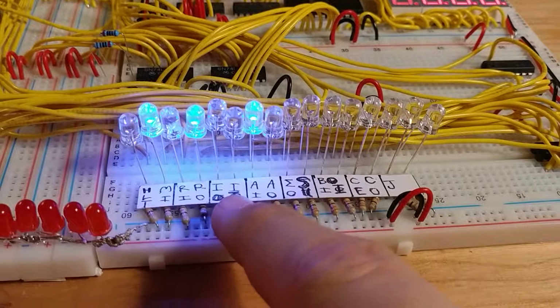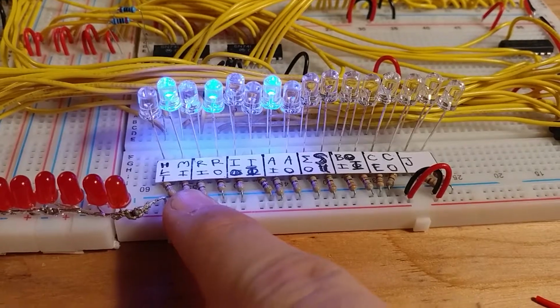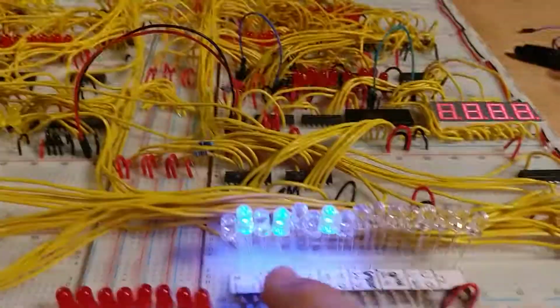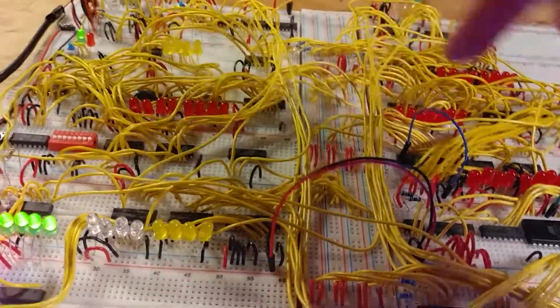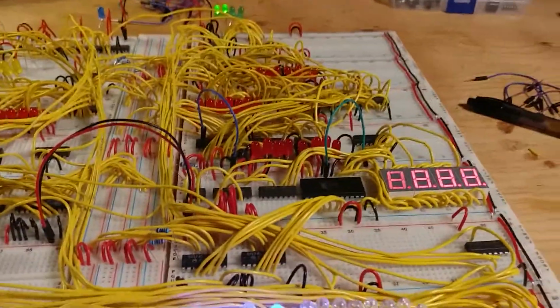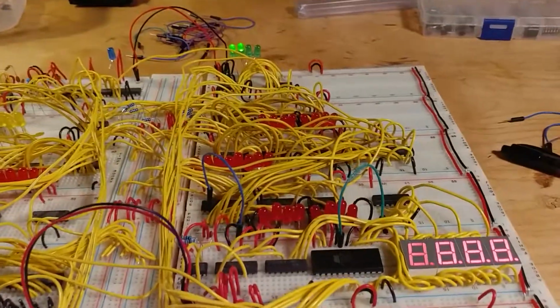But what it would be doing right now is the memory counter in. So this is reading from the bus. The RAM is also outputting to the bus, which is going to cause errors. That's why nothing's working. This value is being output to the bus, which is not working. And also the A register is reading in from the bus. So it's going from the bus into the A register. And the A register is just something that temporarily stores a value, and that value will get erased once power is lost.